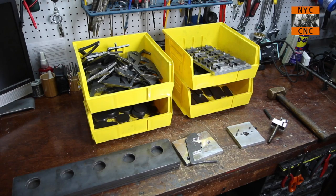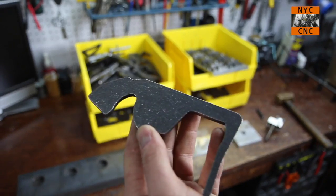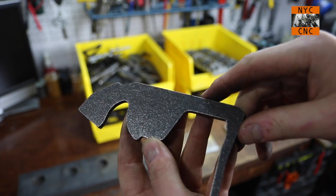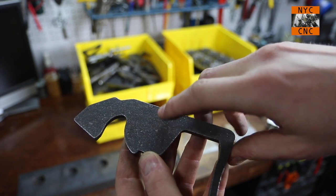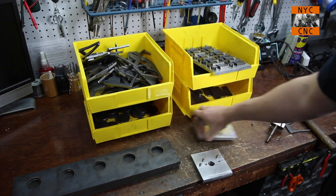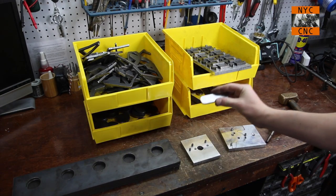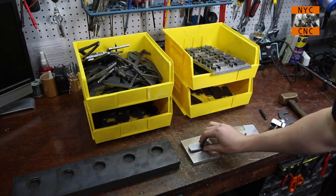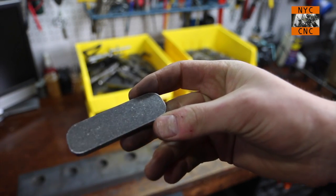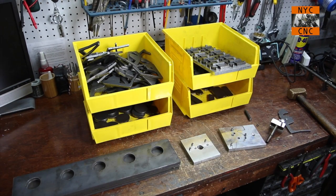This is actually quite simple — you just lay the part on like so, take a hammer and smack it. You can see the hole right there and right there. That's enough on the Whitney punch for you to use the tip to punch that out. This one has to be drilled. Same thing for our reset bar bracket — again three alignment holes. Lay your piece on there, some of these I've already punched. Lay it on there and smack, and you've got two nice holes that you can use for the Whitney punch. So let's go set up the punch and we will bang through a few of these.